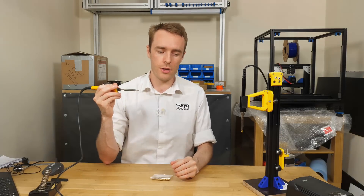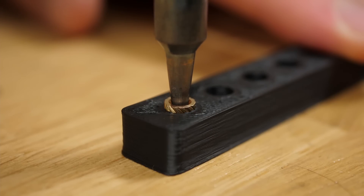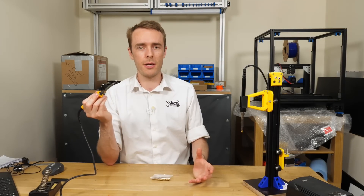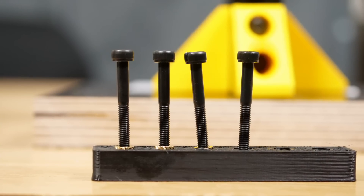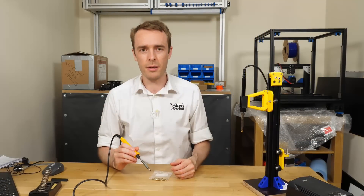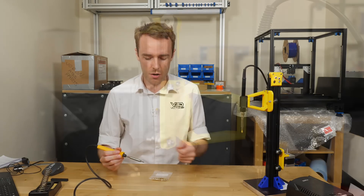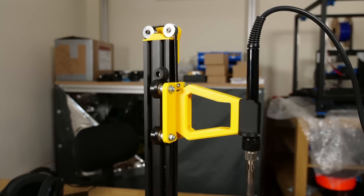As you're trying to push the threaded insert in, it's fine. But as you try to take the soldering iron back out again, the brass insert can sometimes come with the soldering iron and all you've done is make a big melted-plastic mess. The other thing that's very difficult to get right is to get the threaded insert straight. Doing this by hand and wiggling around trying to get the threaded insert off the end is all a little bit clumsy. It does work — don't get me wrong — but you have a chance of making a mess. It takes a little while with an extra piece of metal to hold everything down, and it's just a bit of a fuss.